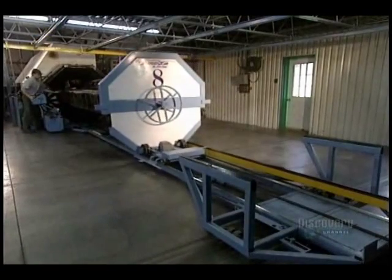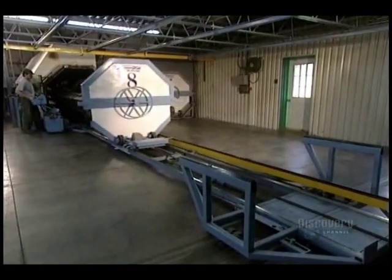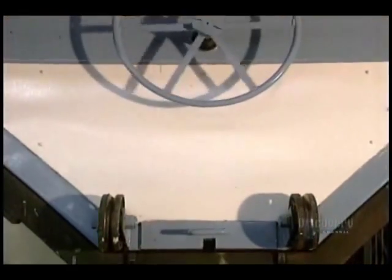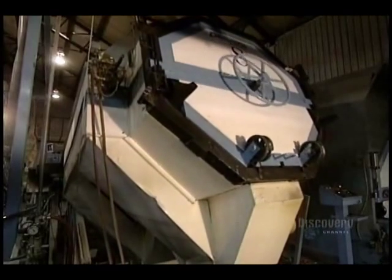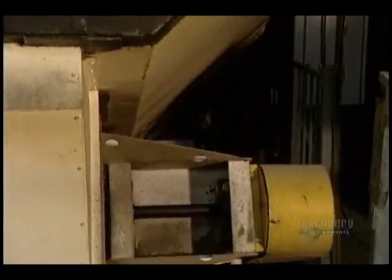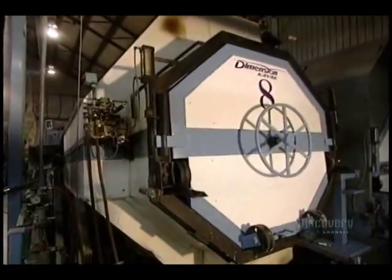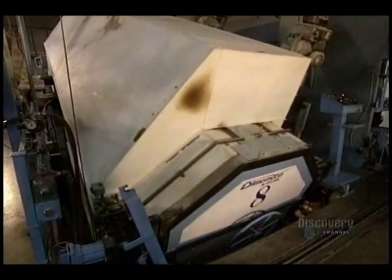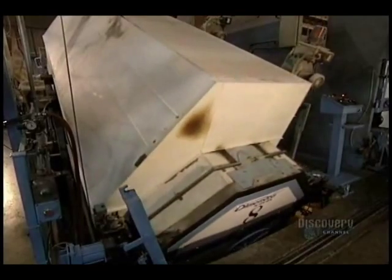The polyethylene melts at 288 degrees centigrade. To completely distribute the powder throughout the mold, it pivots on several axes. It turns on itself while the oven oscillates 30 degrees towards the front and rear. This procedure is termed rock and roll and lasts 19 minutes.